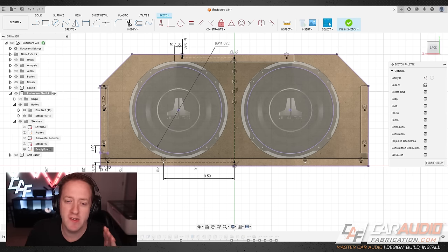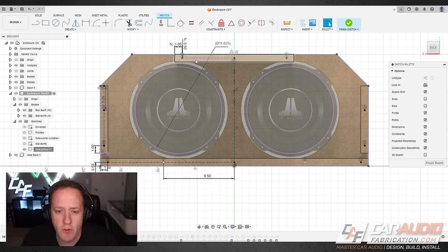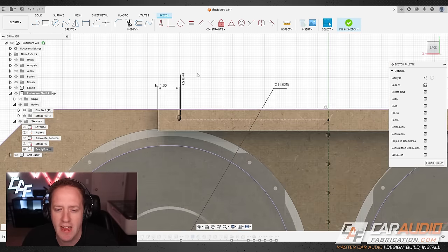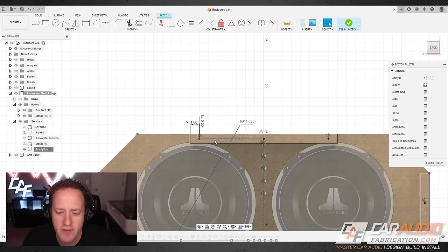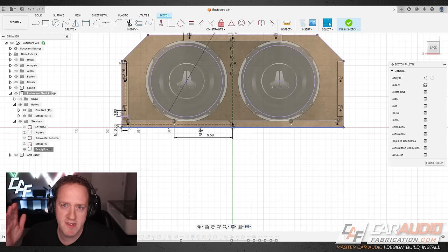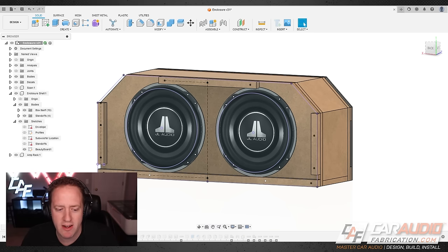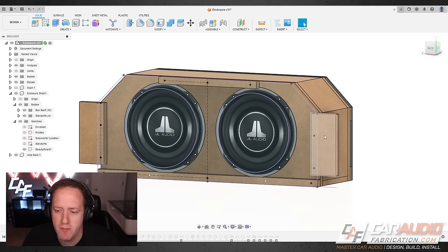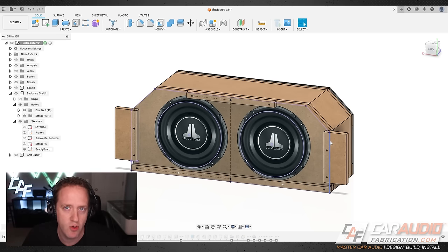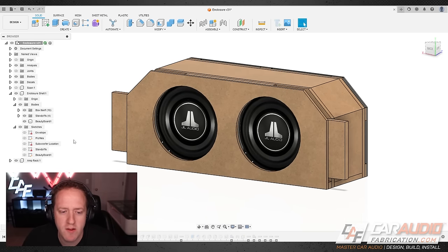This enclosure has around 40 different fasteners tying everything together, and I really like using 3D modeling to plan out fastener locations so you're sure there won't be interference issues during assembly. In the next sketch I'm locating each of the different hole positions, and what was nice is that I ended up modifying those locations frequently to get everything lined up. That's the beauty of a parametric modeling program — I can get 30 steps into the process and then come back to update a dimension.